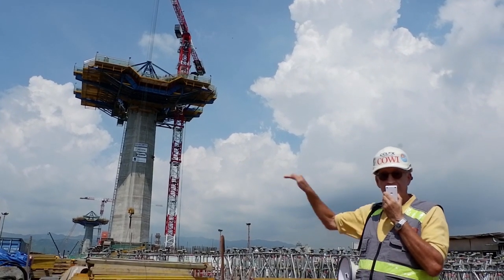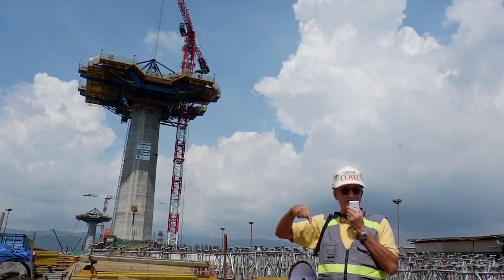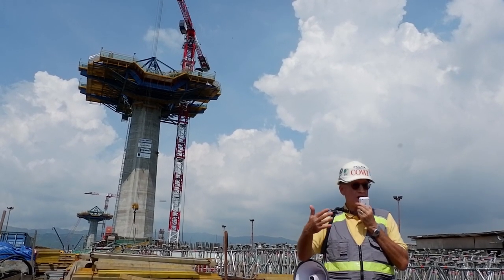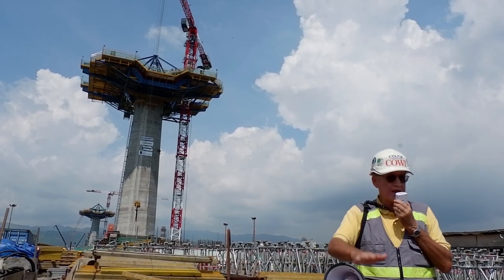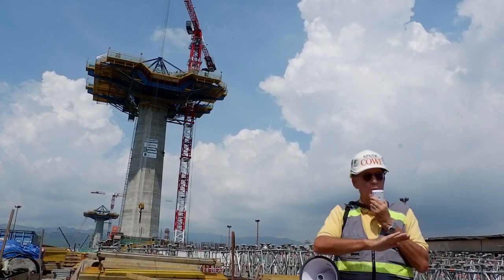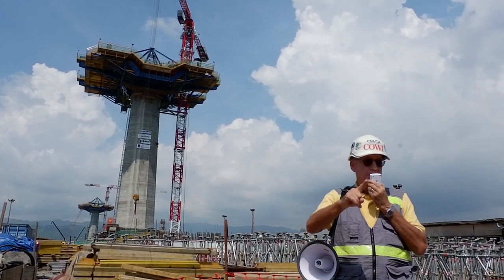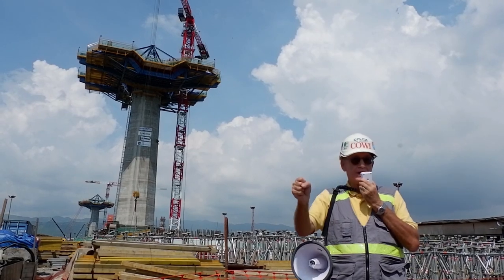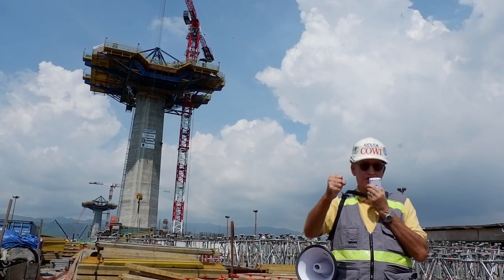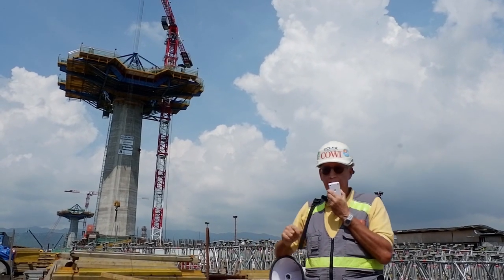So the idea is we don't want to keep the bridge suspended in the middle. We don't want to build this side first and then go and build the other side and then do the joint six months later — that's not on. A bad typhoon comes through and the bridge will actually rock. I was on one bridge where we had to stop work because all my workers got seasick because the bridge was swaying so much. That's during construction — once you join it, it's very strong. That's why we need to try and get it constructed as quickly as possible.